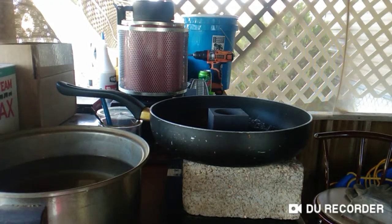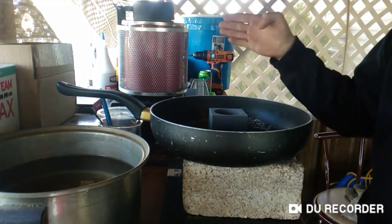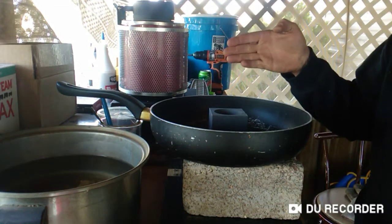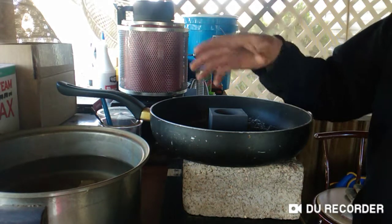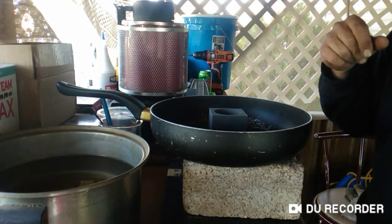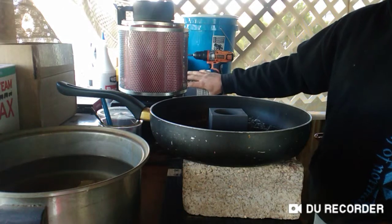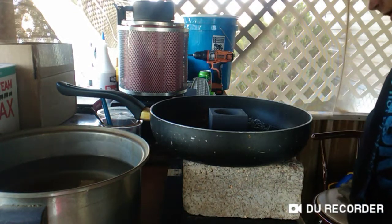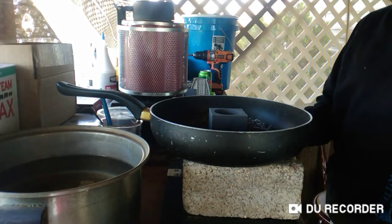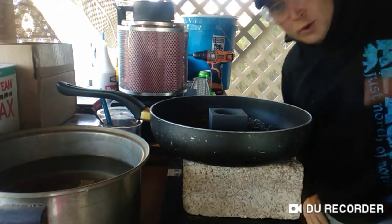Okay, I just wanted to go over a few things. I realized I had a 2-ounce mold, but I have 4 ounces of material plus flux. So I got this stainless steel pan to catch the slag that is most likely going to run off. Also, I have a respirator because when this was heating up, it was putting off some pretty good fumes. And of course, I've got my heavy-duty welder's gloves and the appropriate tooling so that I don't kill myself or anything. And of course, I think I'm supposed to say don't try this at home. I also have eye protection on.